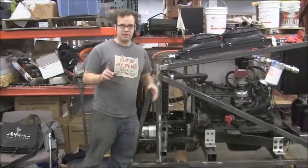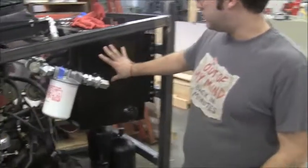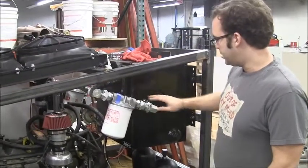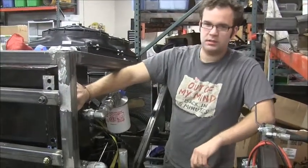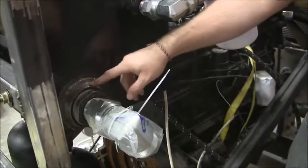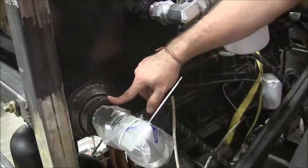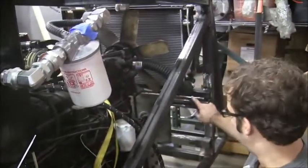Let's start with the first thing you need in a hydraulic system, which is hydraulic oil. This is our reservoir — it has about 25 gallons of hydraulic oil in it. Its job is simply to baffle the oil coming in from the robot and make sure it's not turbulent when it goes to feed the pumps. The reservoir gets clean oil to our pumps via this giant port that we welded on. The port goes to a suction strainer buried inside the reservoir, which cleans the hydraulic fluid before it ever gets to the pump. This giant fitting then sends fluid back to our hydraulic pump system.